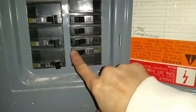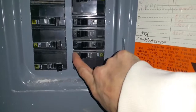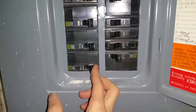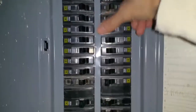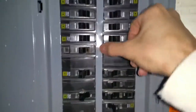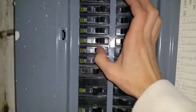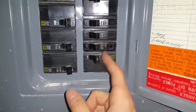Back in the basement. I'll flip the breaker that goes to the box upstairs off before doing anything else. Before I turn the power back to the house from the grid, I'll go through and flip everything off — 12 is already off. Now I'll restore power from the grid and go ahead and turn all the breakers back on for the house, except for the generator one.